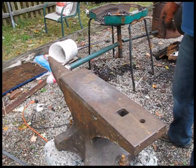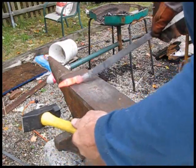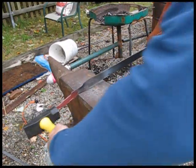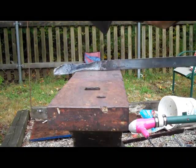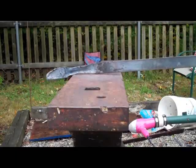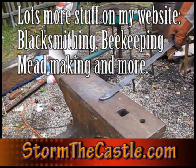The next two types of hammer blows are back face and shearing. The interesting thing about back face hammer blows is it also does something called upsetting the metal. I'd put this here and hit it this way — this upsets the metal, it will actually make it thicker and bigger here. That's a back face hammer blow, and it upsets the metal and makes this section larger. But then there's also shearing, where you blow it here on the edge and shear the metal right off. Where this is all red hot and ready to go, I would strike it this way to shear off this metal — it would break off. There we go, sheared that piece right off.